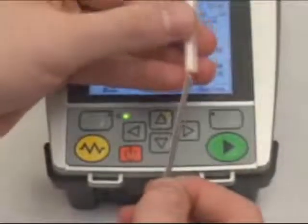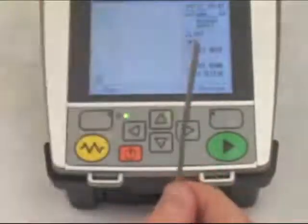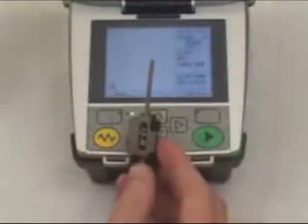The first step in the process is to take the protection sleeve and slide it over the ribbon. Next, insert the 12-ribbon fiber in the fiber holder. Ribbon splicing requires a thermal stripper to remove the matrix and protective coatings on the 12 fibers.